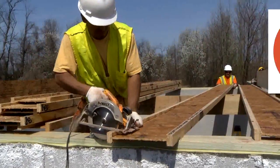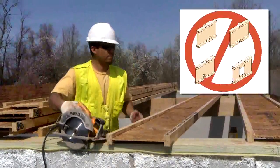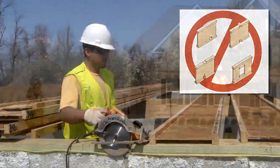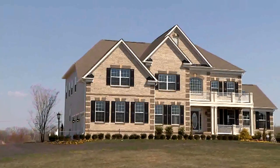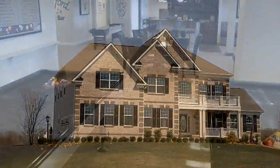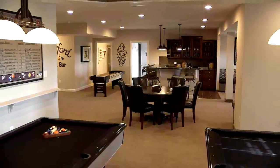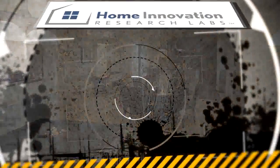Flanges can never be cut except when cutting the I-joist to length. Do not use damaged I-joists. Following practices presented in this program will result in a sturdy structural floor frame that performs solidly for many years, providing added value to the builder and the homeowner.